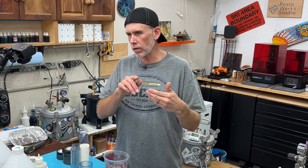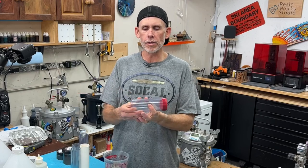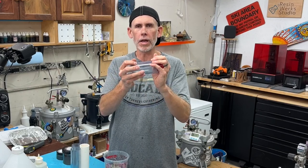Now, the instructions recommended making basically a jam chuck. Drill a 7mm hole in your blank, create a tenon on a waste block piece, and then use that as a jam chuck. It just seemed like a lot of complicated unnecessariness. You could do that if you wanted. Another way to go is to glue your blank onto a glue block and then part it off, drilling from one side and then turning it backwards, where the hole's on the one end. There are lots of different ways to work hold. I think the easiest way to go is the stopper mandrel method.